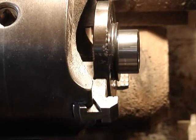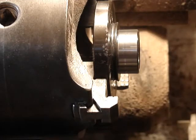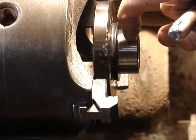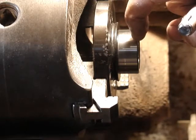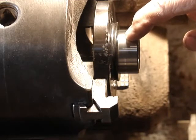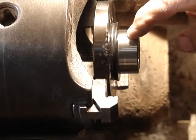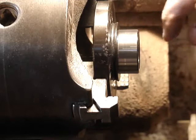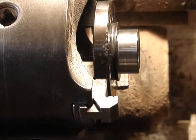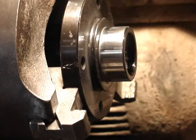With the flange mounted up in the lathe, we can now quite clearly see a ring which has been polished by the oil seal. If you run a fingernail across that surface you can actually feel — although they're very fine — the turning grooves in there. Polishing that surface is what has actually worn out the sharp edge on the rubber seal. What I'm going to do is quickly polish that area where the seal runs so that when we put the new seal in, the sharp edge on it will survive a bit longer. There we can see that whole area has now been polished with 1800 grit abrasive cloth, which will give us a much better life out of the new seal.